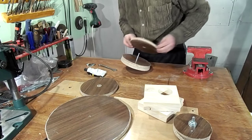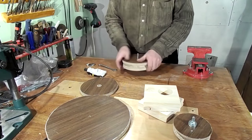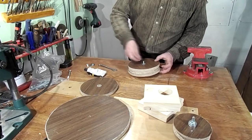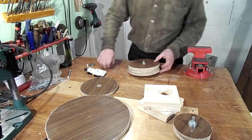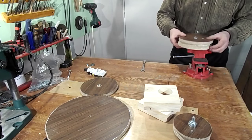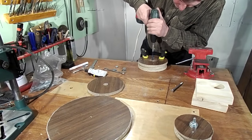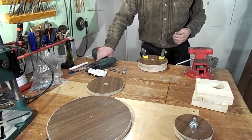Now I need to insert the pulley axle, which is made from an 8mm bolt. This bolt has a long smooth portion having no thread. The bolt head protrudes above the plane, so I drilled a place for the head, and then the head was lowered into the recess.